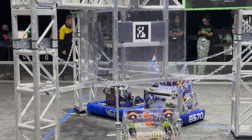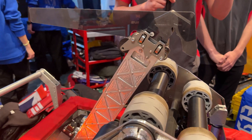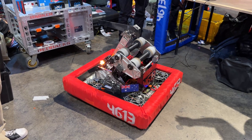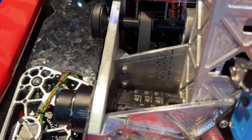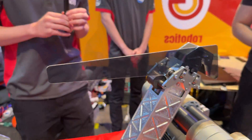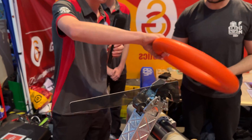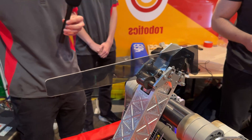Can you tell us about your climber? Our climber is just a single hook which attaches to any part of the chain, and we're able to climb quite confidently with another robot if we move our robot to the side. It's powered by a single Falcon geared 64 to one. It's two stages and powered upwards by constant force springs and winched down using some high strength cord. A lot of teams have asked us what this feature is for — it's so that if the note happens to fall back onto our robot, it can't fall onto the climber and disable us for the rest of the match.